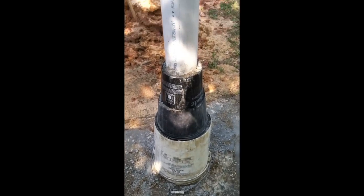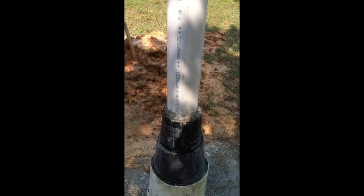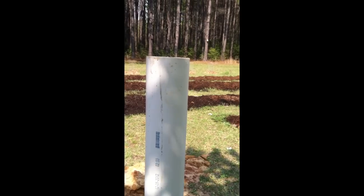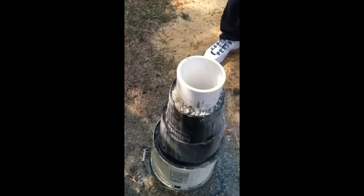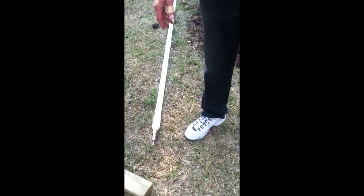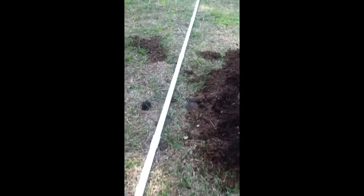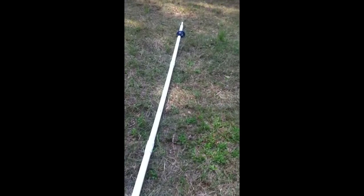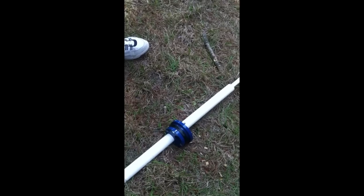Here's the final well casing inserted. I put buckets around it, cut the ends off, and cascaded them up, then put concrete around it and let it dry for a good week. The casing is sticking out and I'm going to cut it off about six inches above the piece here. The actual cylinder is ready — remember it's two pipes, 20 feet long, assembled outside and then inserted. There's the top of the well head. You can tie a string to the foot valve just in case you drop it in.